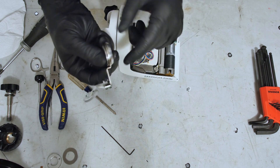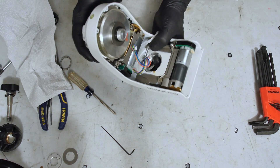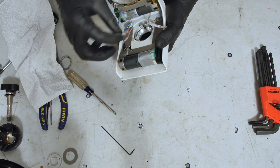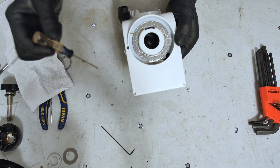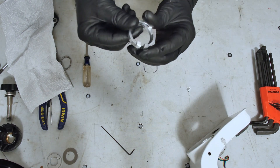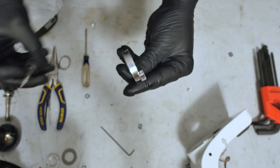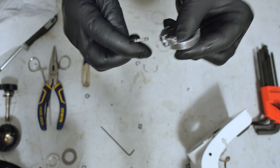Look at all these little parts that have to be made. Some of these are maybe generic, but a lot of these are definitely custom parts. So the fact that they're able to make and sell this thing for what they are is rather impressive. Now this part and this clamp part that I'm having problems with — this is the last thing in here. It just presses out from this side. And there it is — this is the part that is broken and damaged. The threads are stripped. This is supposed to thread into there and there's just no threads at all in there anymore — completely blown through.